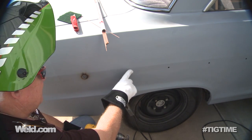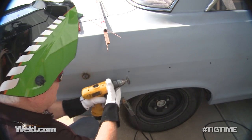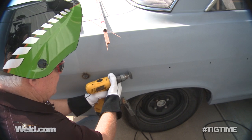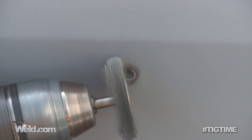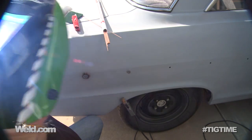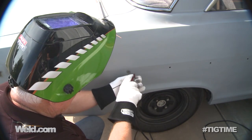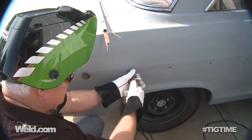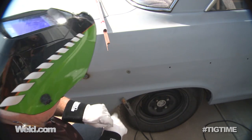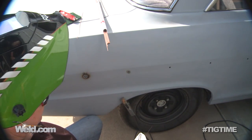You can see there's a lot of foreign matter here — everything from primer to masking — it looks like it's on the inside. So I've got to find a foundation of metal to start working with. I'm going to use an aggressive wire wheel here. At least I've got it down to bare metal now. There's still a few things inside I'm going to try to scrape out, but they're quite a ways inside — they're likely to burn away as soon as I start my arc. You can see they're still there, but I'll light an arc and they'll disappear.